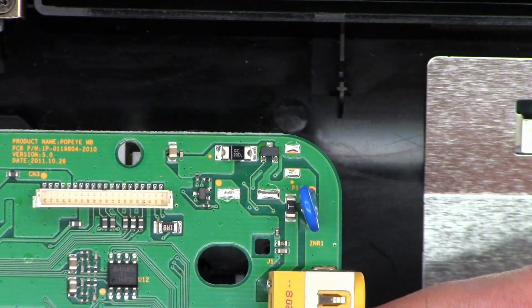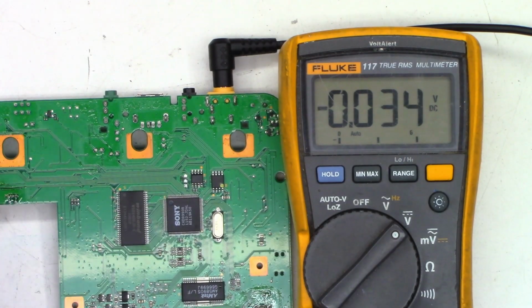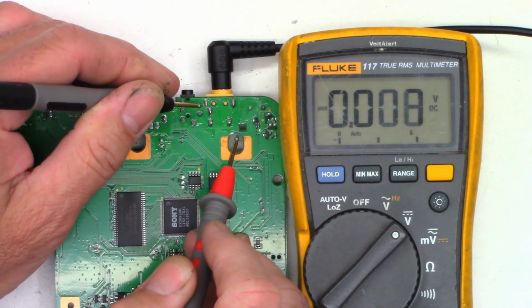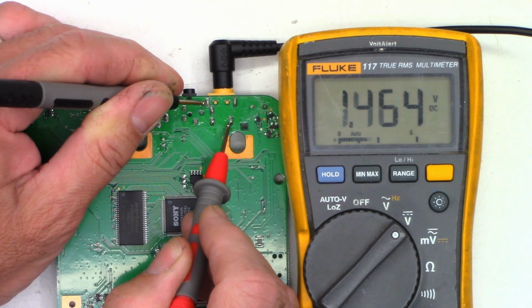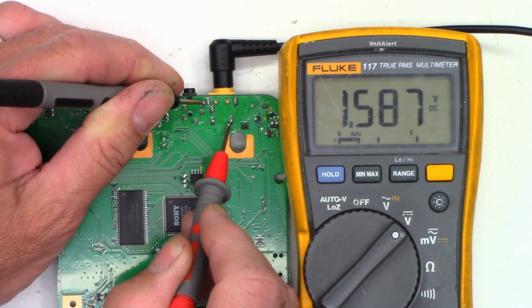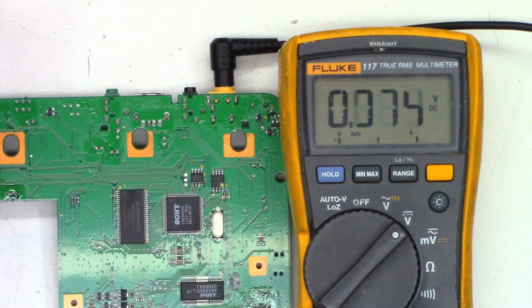So now we can actually power this thing up on the bench without the laser diode connected and see what we get. So I have it powered up right now. Let's go ahead and just connect the negative to ground, and then this should be the positive lead. As you can see, it's pulsing on and off, just like the current meter was on the variac. And I do see the needle on the variac doing the exact same thing. So somewhere on this board, there's going to be a short. Hopefully it's just a little bypass capacitor that's shorted and not internal to one of these ICs.